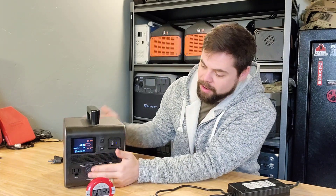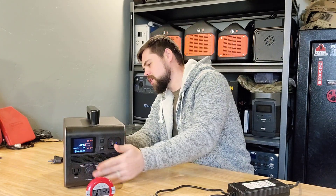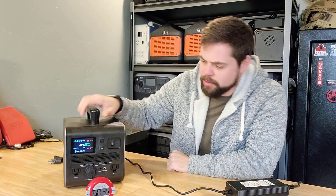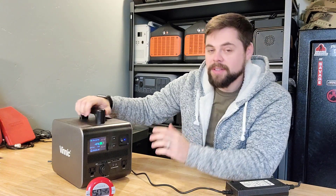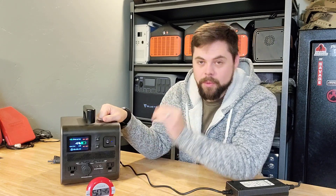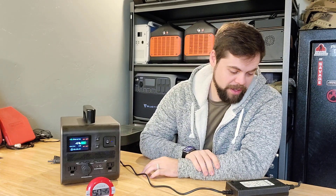This does not feel hot at all — it's barely, barely warm, very cool to the touch. The fans were not loud at all; they were very, very quiet. Going ahead and plugging the wall charger in, it started charging right away with no problem. If you've been watching my channel, you know there are some units where after a heavy load like this they've started melting down, catching on fire, crackling, having big issues. So it's really cool to know that even after running a full load at one C rate discharge, this has no problem getting charged back up with the wall charger.